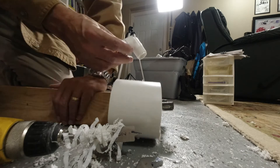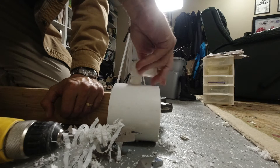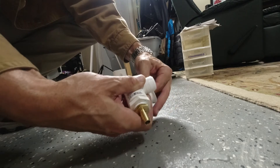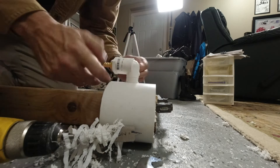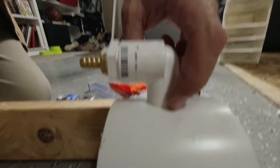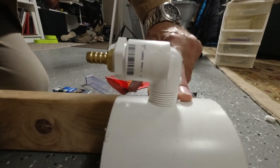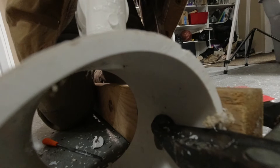Now I have my piece that I've already made that's going to actually go into my threads — I'm just going to test it out. You're going to use Teflon tape for the final installation. It's perfect where it just comes through a little bit, and when I put Teflon tape on that, that'll prevent any leaks. I'm not going to have to modify this by cutting holes or drilling when it's inside the pipe at that level. I think this is going to work perfect.